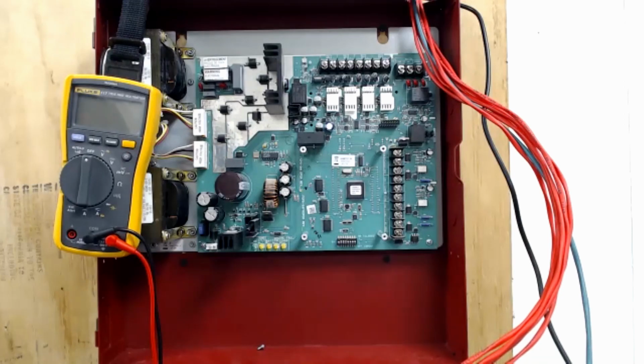For field devices like strobes, horn strobes, speaker strobes, smoke detectors, pull stations, and so on, the point of that service loop also comes in if a device has to be moved. Like it's been installed, say, in the direct center of the room, and then the air conditioning guys come in and they drop an air vent right beside that smoke detector. We need enough wire that even though that device is already installed, we now have to move it away to maintain a 3-foot minimum distance between the air diffuser and the smoke detector. So we need to have enough wire there that we could cut a zip tie and move over somewhere so that we can maintain that code required distance. So the service loops typically provide that, that's like their main function. So I want to just say, make sure anything you're doing, you're leaving a service loop.